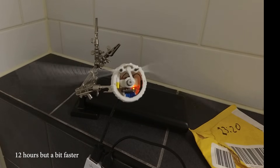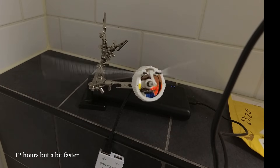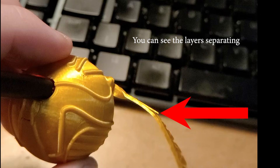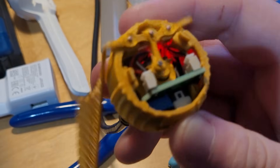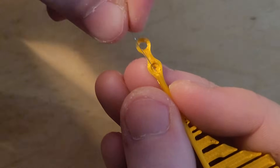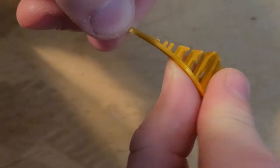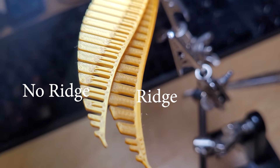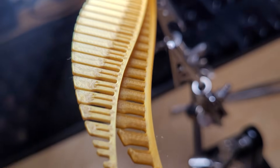The wings needed to survive for at least 10 hours of constant fluttering. Printing the wings in white PLA seemed to work fine, surpassing the 10-hour benchmark without a hitch. So I switched to gold PLA — which didn't last more than a couple of hours. Then I switched to a stronger gold PETG, which had the same problem. Both the gold PLA and gold PETG failed within a couple of hours. At one point I reinforced the wings with a small spring steel wire, and they actually held up. However, that would add another step to the assembly process. So I added a tiny ridge to the edge of the wing, which made it more structurally sound and resulted in the wings surviving 10 hours of continuous use. I stopped the test after 13 hours — the wings passed with flying colors.